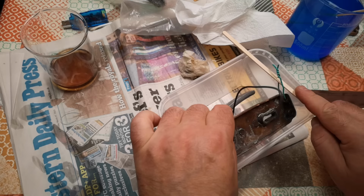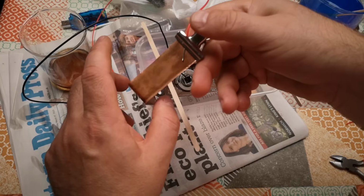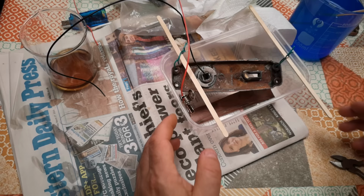That's going to get it into the plating bath. That's going to be completely immersed. And then my copper anode can go in there like that, and nothing's touching. All looks good. And there's room in there for me to stir things without getting in the way.